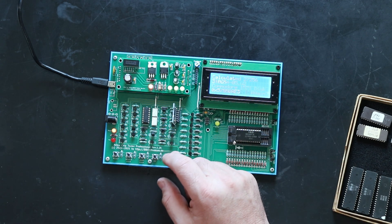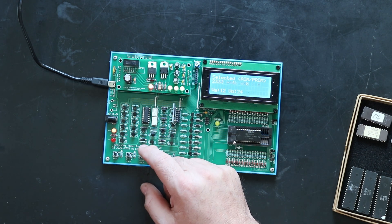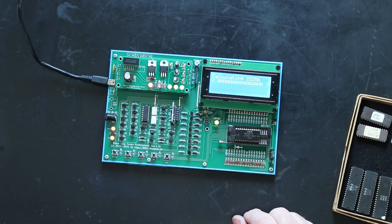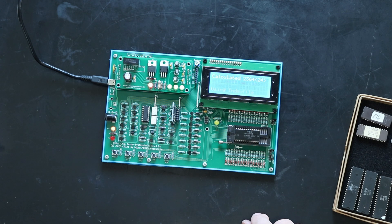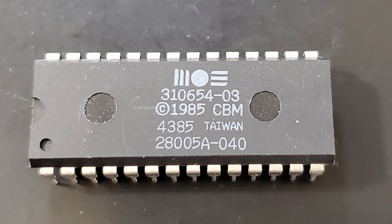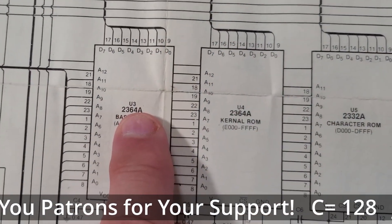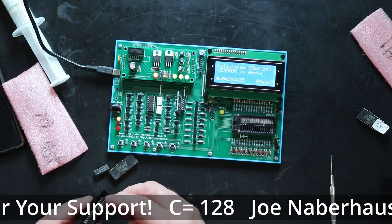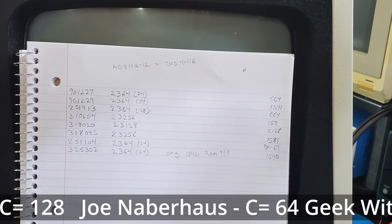The Commodore ROMs had another challenge: while an EEPROM is labeled with the IC type such as 27256, the original ROMs are masked ROMs labeled with a Commodore part number based on their contents, not the IC type. I started by guessing, but that was silly, so I went to schematics and Google where schematics weren't at hand. I made notes as I went and I'll add a page to my blog where you can see the results — as I come across new ROMs I'll add them so you can easily look up the correct settings for a given Commodore ROM.